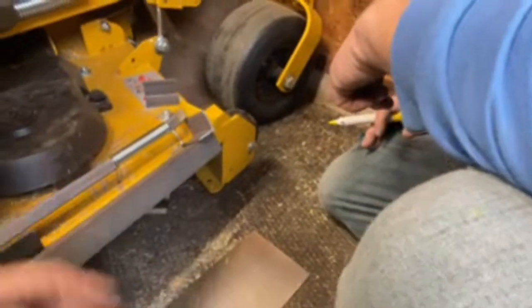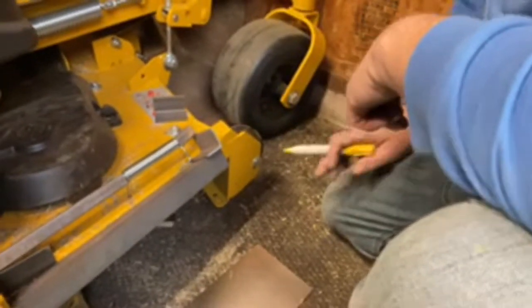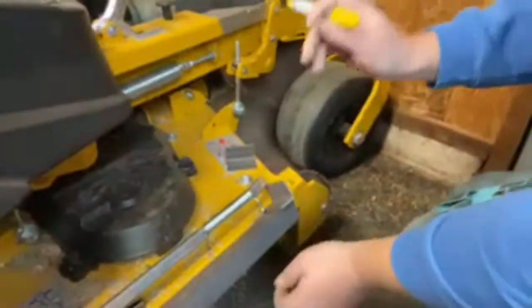So we got that, and that. So this inside plate, we'll weld it where it's on the inside of this angle. So it goes right up against that right there. Because if we had it on the outside, it would be a gap right here all the way down. You know what I'm saying? Either way, we can weld all this first, and then weld that last. Probably do that first, so I can do the inside. And then all this other stuff's just top.